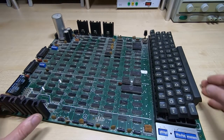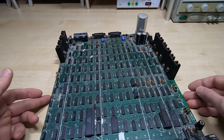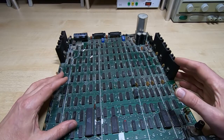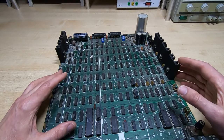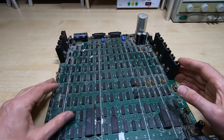It's mostly glue logic — most of the functionality is done entirely on the fly through the 74-series logic chips festooned around the board. There are no components on the other side; this is just a two-sided board. It is quite big, and the main thing with these types of boards is they draw a lot of power, and quite often when they start to go wrong you can get a kind of cascade failure.